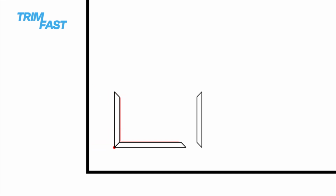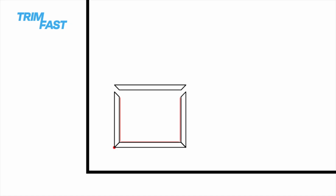Repeat this process on the opposite side of the frame. For this step, however, we recommend that you do not fully adhere the panel to the wall until you have also lightly adhered the top portion of the frame to the wall. This will make any adjustments that may be needed easier. Once you are satisfied that all of the trims are level and correctly aligned, apply pressure to them to secure them to the wall. This will complete the installation of the lower panel frame.